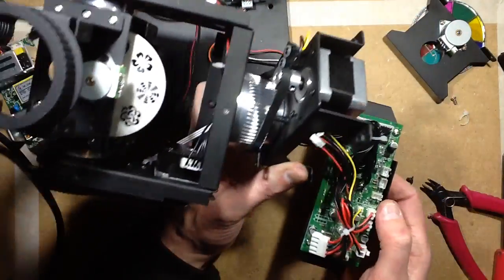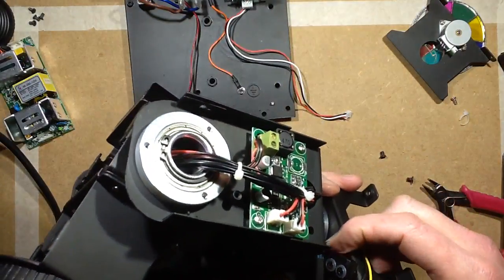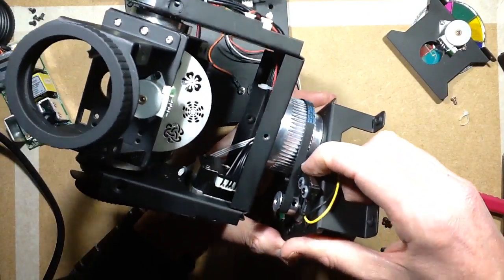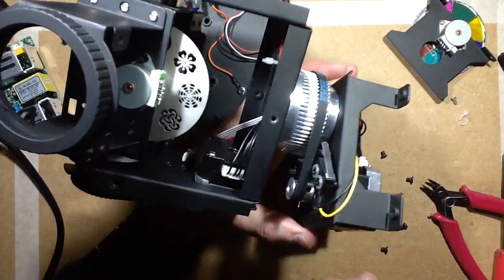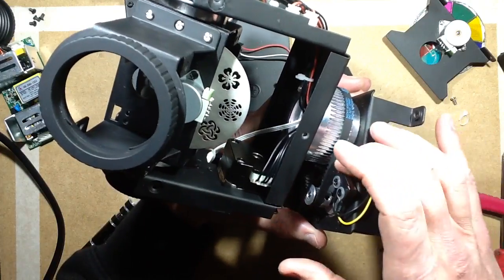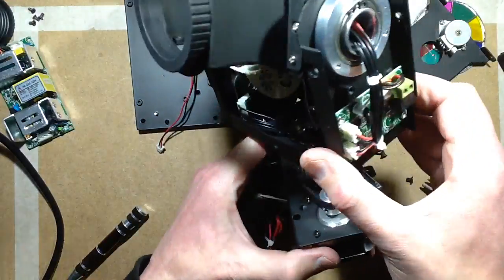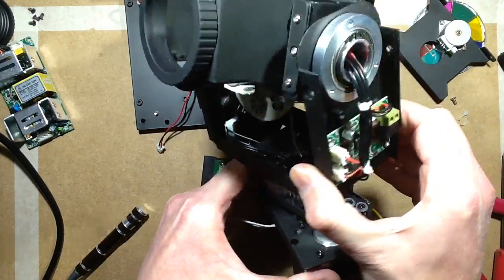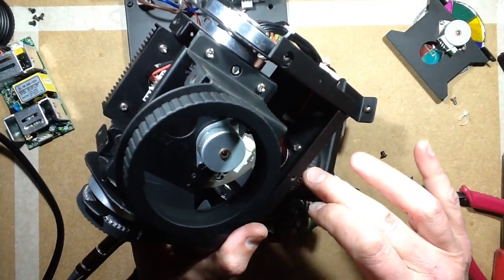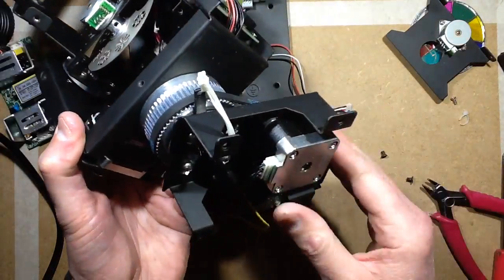That's quite nice. So now we've got this big chunky stepper motor with its little switch. Incidentally, if the motor slams round and goes beyond the switch, the next thing after the switch is a physical limit, so it will physically stall it. I've not tried it yet to see if it will still initialize if the switch isn't working, or if it'll just skip against the end, not find its switch, and sit there shuddering at the end, slipping in the motor. But that is really robust, isn't it? This is a huge machined bit. Again with the slip rings and the curved parts, it's pretty impressive actually.